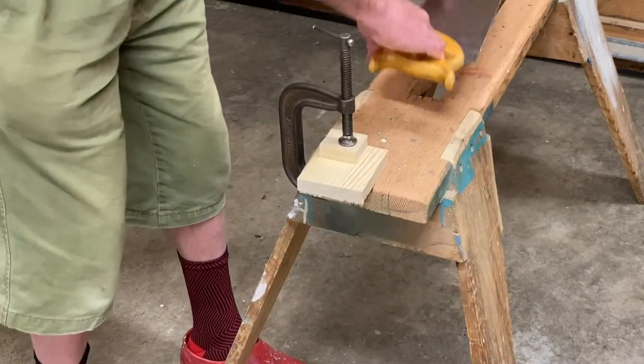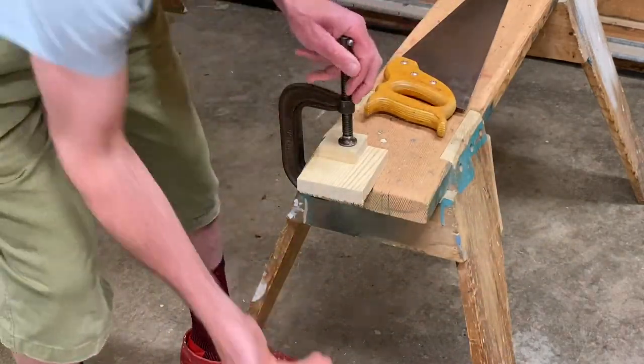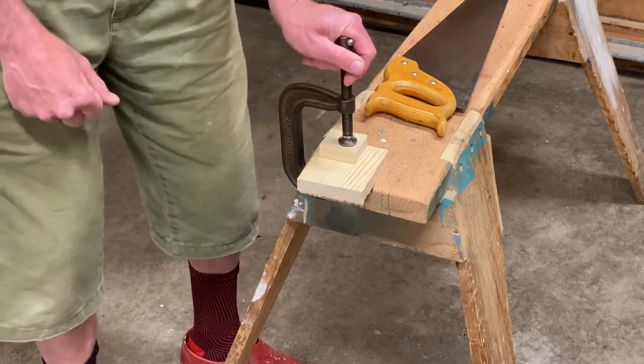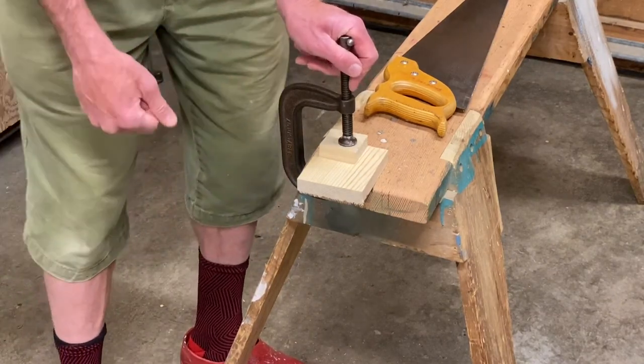It's really important that they don't reach down to pick up the wood right away, but that they put the saw in a safe location first and then pick up whatever wood is on the floor — otherwise they can swing that saw around and hurt somebody, particularly themselves.